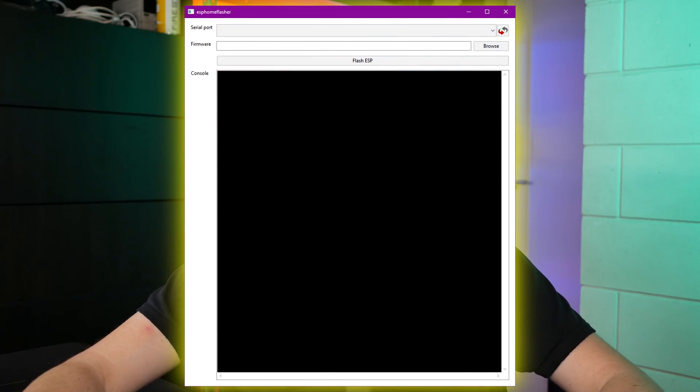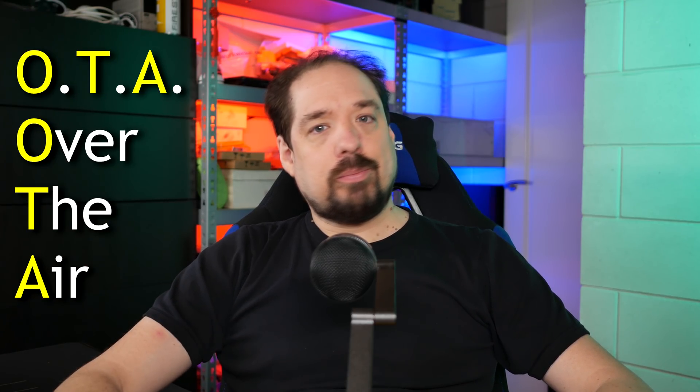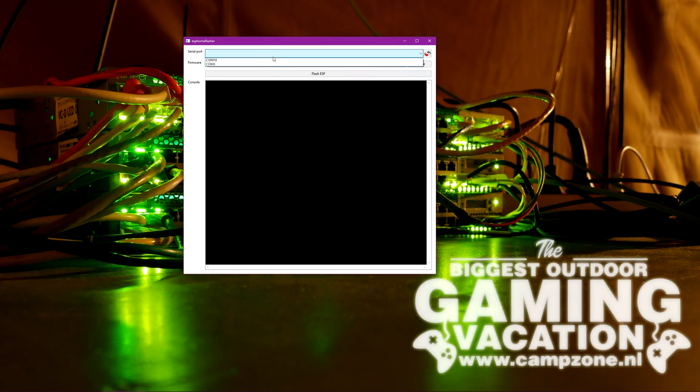While it's building that, let's plug in our ESP32 module. This is a MHET Live ESP32 that I like to use, and as always I'll have some links in the description for that. After the compiling is complete, you should be able to push the download binary button and download it to your desktop. On your desktop, we're going to use a tool called ESP Home Flasher. This tool is specifically made to do the first flash using USB to one of these ESP32 modules. After that, you don't really need it anymore because you can flash it over OTA, or over the air — it's a very nice technology. Once you open up the program, select the correct COM port, then hit the browse button to select the binary file we just downloaded. Then it's basically just hitting the flash ESP button and it should start erasing the flash on the module and uploading the new code.